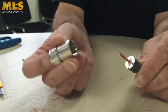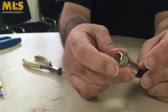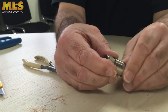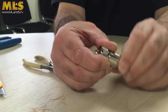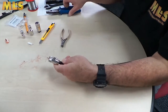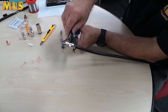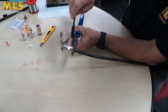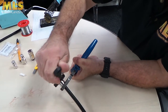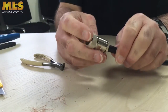Once you've got that, you get the main body, line that up, and push it all the way in there. You can see it's coming out - I cut it a little bit on the long side. With that, you then just screw up as tight as you can. A pair of suitable pliers and spanners is very useful. So that's now compressed the gland so that the back end of the plug is now waterproof.